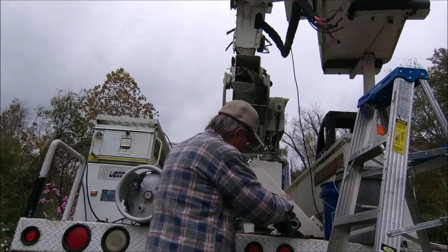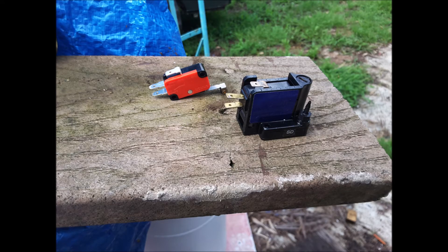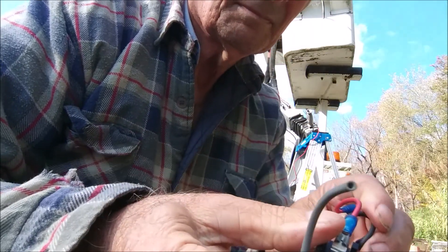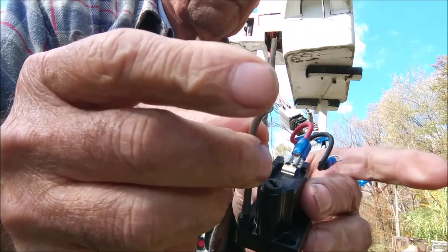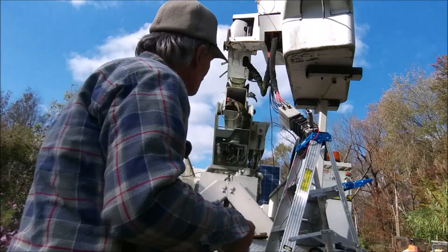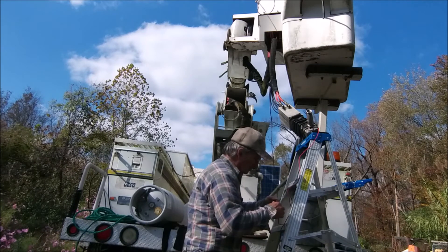That's it for this part. The other part is about testing. This is a quick sketch of what the air tubing looks like — it goes to the push button on the deck. That little switch in there is an air-actuated switch; it's just a snap switch when you take it apart. This is how you'd test it with a screwdriver, but you still have to blow air into it to get it to work, otherwise turning that screw won't activate it.